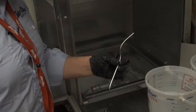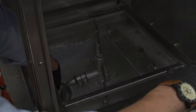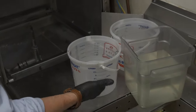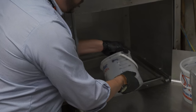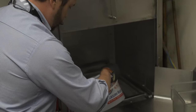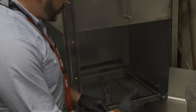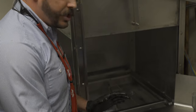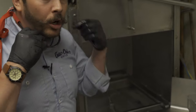I always find something in the restaurant that's just laying around — whether it be a butter knife or a fork — and I mark the water level. Then I drain out all of the water by pulling the drain plunger up, making sure all the water is out. I have a couple buckets of water sitting here — each is a graduated cylinder with a gallon of water. I let the drain ball close and pour the water in one gallon at a time slowly so I don't slop up and move my indicator. That's one gallon... there's two gallons of water. The water is splashing a bit but we're right near the indicator — this machine is using roughly around two gallons of water. The Autochlor single pass A5, same as this, would be one gallon of water per wash cycle.